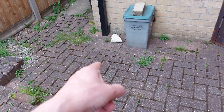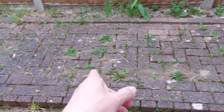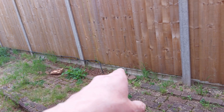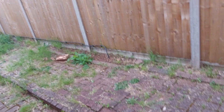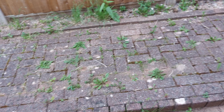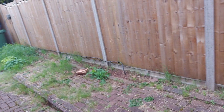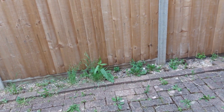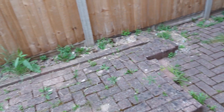We don't know what depth it is either. It's got to be at least below the depth of those pavers — it could be six inches, it could be two feet deeper there. I've checked all the way along there and there's no obvious signs of damage along where we can see it. So my guess is, somewhere under here it's been damaged. I don't think it was when they did the fencing because it was working fine for quite a while afterwards. On the other hand, they could have nicked it, damaged the casing, and it slowly corroded — giving us the problem we have now. Without digging it up, we have no way of knowing.